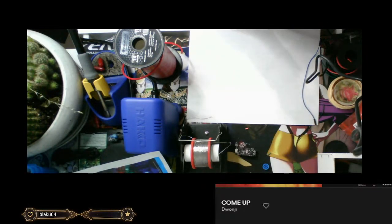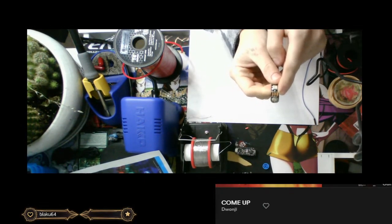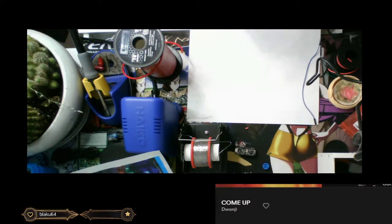You're going to want to always trim, guys, on that little copper line there. You always trim with your scissors on your copper line, because if you trim anywhere else, you're not going to have usable LEDs anymore. I tried to get as many strips as I could out of the roll. I only needed one roll, so remember you're only going to need one roll, depending on the size of the strip you buy.